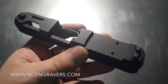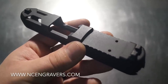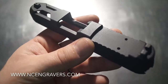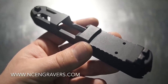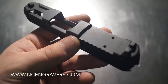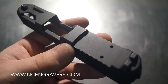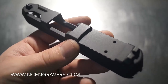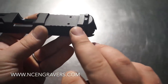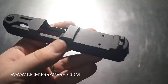We'll add some pictures. Once again, getting back to that hole, I probably wouldn't recommend hitting the hole if you're doing something like a Viper. A Trijicon, which we're not putting on here, has a battery on the bottom. The Venom, or maybe it's the Viper, not the Venom, it's the Viper, now that I'm thinking about it, sorry, has a battery on the bottom, so you probably wouldn't want to hit that hole if you had an open bottom optic. Obviously the Romeo Zero has an open bottom, so you're not going to want to do that even with that small optic. You'd probably want to recess this back, which we've done an adjustment on our measurements so we don't go that far forward, and then you wouldn't have a battery issue. So it's just something to take into consideration.